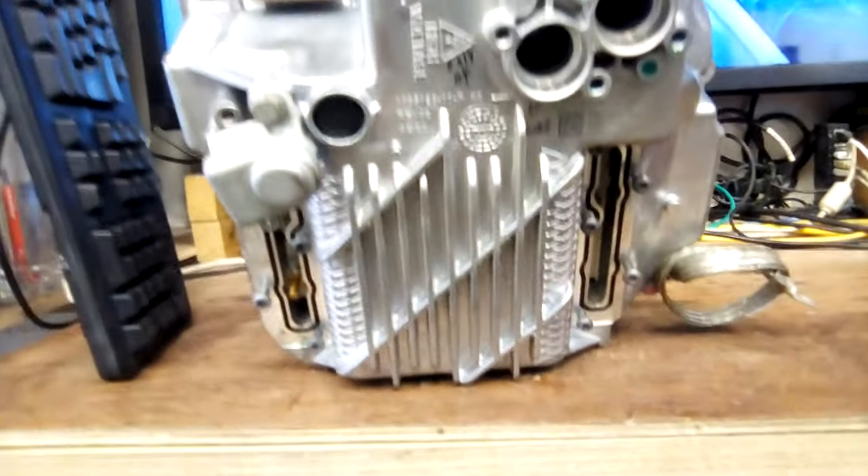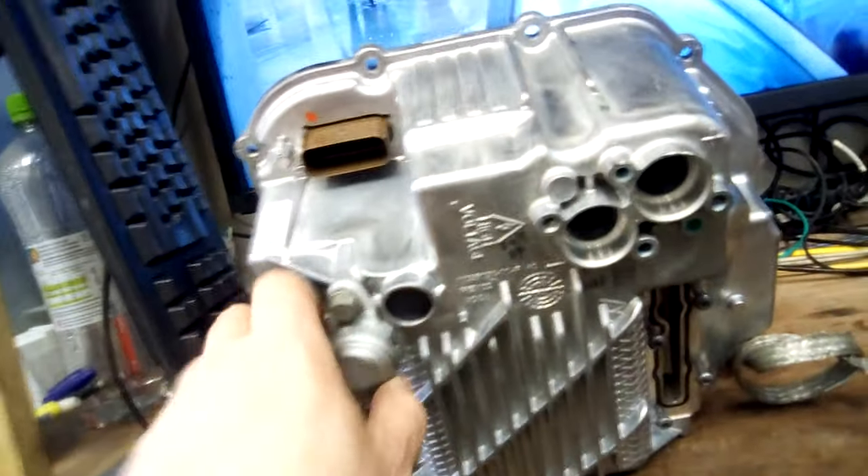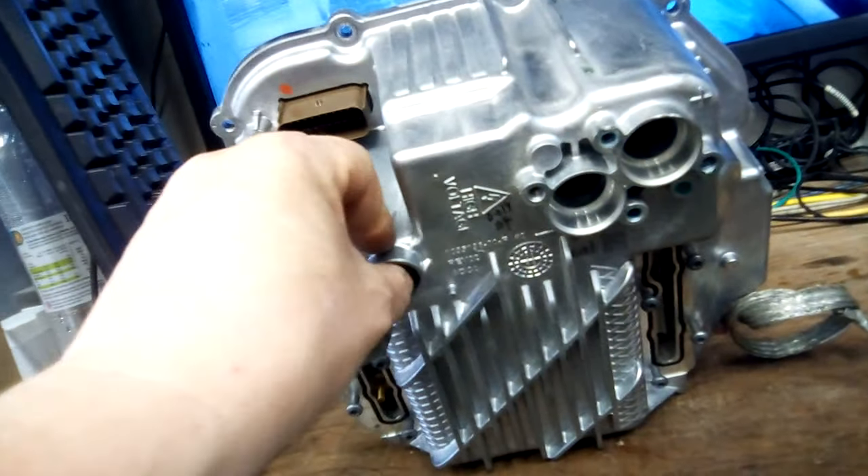You can see there are Torx screws on there just for circulating the cooling. Under here is going to be the IGBT - it's probably a single module rather than multiple half bridges or single units. That thing covering it - I'm not sure what that is, maybe some sort of reset button. The power connections are under there somewhere, and you've got the orange three-phase outputs that connect up to those things. You have to undo those to get the inverter off, but basically it's all these 10mm bolts plus the three and then it comes away.